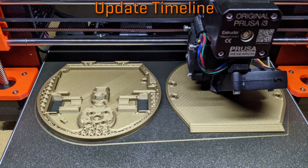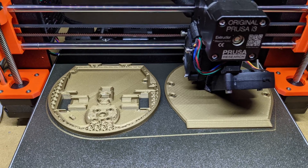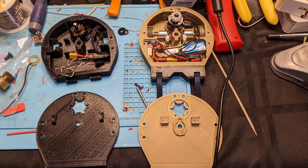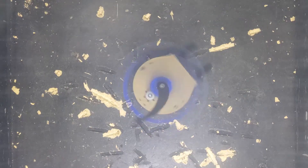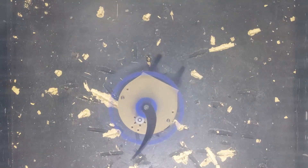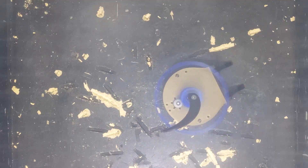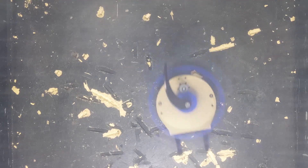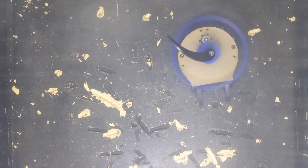I had been using a script up to this point, but now I'm just winging it. So back in February, right after that competition where Mini Mulcher took off Division's wheel, I realized that it was kind of a stupid idea to have it be completely incapable of moving at more than 1 mile an hour. So I actually designed a new chassis revision back then that allowed me to fit the N20 motors that I'm now using. I printed the chassis in PLA, made sure the things fit in it, and then promptly forgot about it entirely for several months.